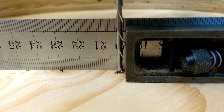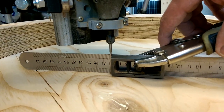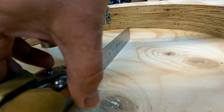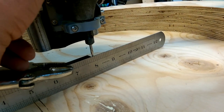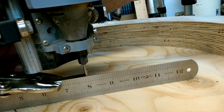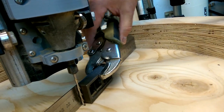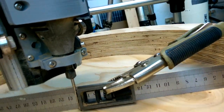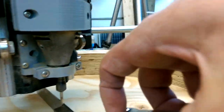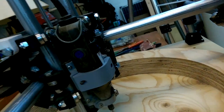You can just barely see it in there, but that needs to move to the left - just about a millimeter. When I run this around I have about a uniform gap all the way around - maybe half a mil there, half a mil there, half a mil there. That's pretty centered right there. So I am going to clamp that down and we'll be ready to mill.